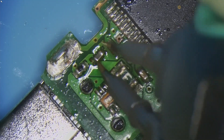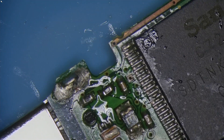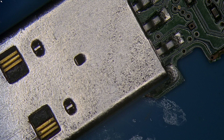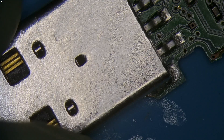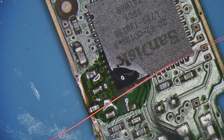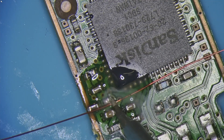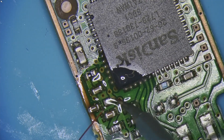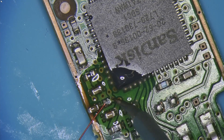Let's say we didn't know that this component was bad — what we could do is put an isolated wire in there and clean off that wire a little bit further down the line so we can test it. That's where we're going to do the injection.